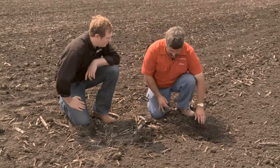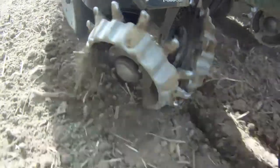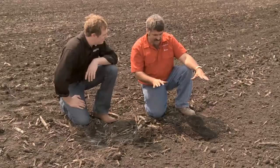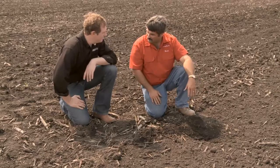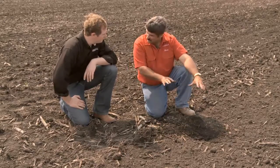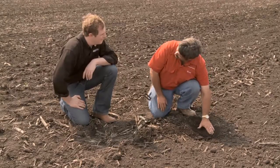The reality is this field is ready to plant if we teach the planter to dance. If I had time I'd give it more time, but June 3rd we don't have it. We have a planting environment at the surface and we're getting this top layer off so it won't stick. The trick is to leave this soil in place and tuck the seed into this moisture down here. A grower not paying enough attention will move this soil out of the way with his row cleaner, ending up trying to plant in that wet environment down below. You need to stay as light as you can on the planter and down pressure, stay aggressive with your closing, but don't move this good surface soil out of the way and force yourself into the wet stuff.